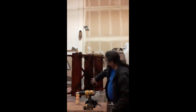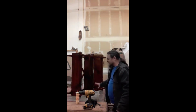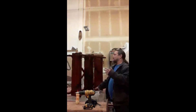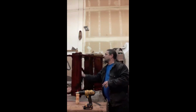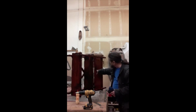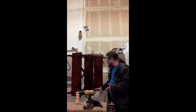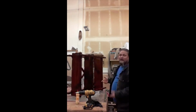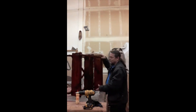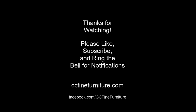If you look, I'll turn it this way so you can see it better, you can see all of the different colors in the wood. That's not necessarily a product of what he did. That's a combination of age and the original stain that was put on it, and then the dye that he put on it, and the water damage that discolored it. If water and iron are in contact with wood, it'll stain and make these really dark things through here. But then the knots always darken with age, and they take stain better and everything else too. But that's part of the beauty of these old pieces. I can imitate this color and this stain, but it would probably take me 30 or 40 coats of different stains and color to do that, where Mother Nature did it all by herself in 30 or 40 years. Unfortunately, she also made the damn thing fall apart. So that's why it needed to be repaired.